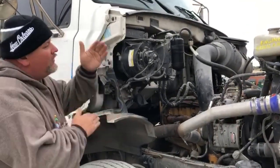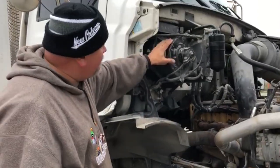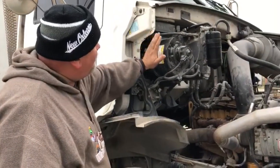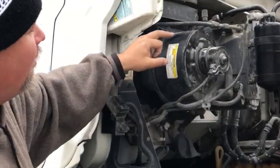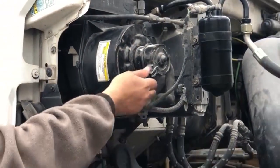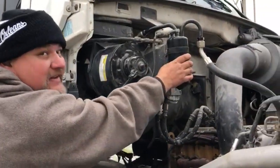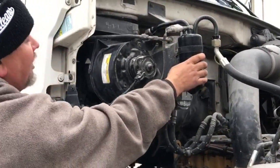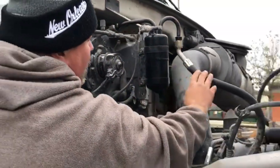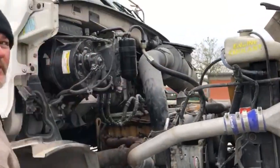I start always top to bottom and back to front. This one is the AC blower: properly mounted and secured to the cabin. It's plastic — no crack, no break, no damage, no missing bolts. The wires are properly attached — no fray, no cut, no damage. The AC dryer is properly mounted and secured to the cabin. No missing bolts, hoses are properly attached, and I don't see any cuts, no bubbles, and no leaks. It's in good condition.